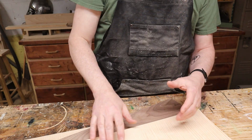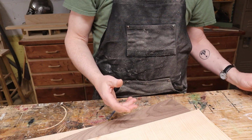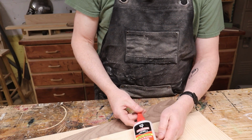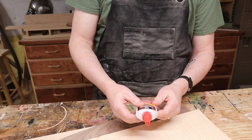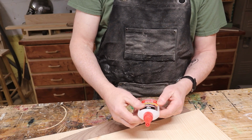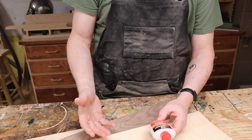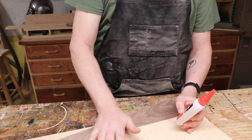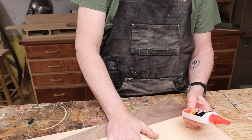So I talked to a friend of mine who's a real woodworker, professional woodworker, and asked his opinion, and he suggested a resin-based glue. So I'm going to try this product from DAP. Never used it before. Looking at the ingredients, it's essentially a long cure time crazy glue. So I'll use a minimal amount, spread it out really thin, put the layers under a lot of pressure, and hope for the best.